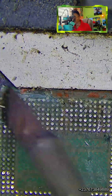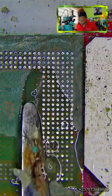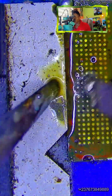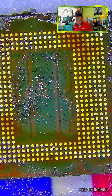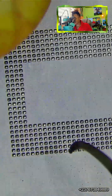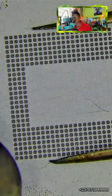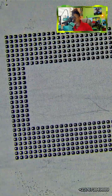As you can see, I'm cleaning the glue from the IC itself, which is the RAM. I did not remove the CPU of this mobile phone — I'm just working on the RAM and I want to reball the RAM. If you are wondering how I decided that the RAM was the problem causing that particular reading from my DC power supply — it's very hard, but with knowledge and experience after working on chip-level components like the CPU, the RAM, the EMMC, you will be able to know that. You'll also learn about DC power supply readings from my courses and my book, The Block Diagram Master.